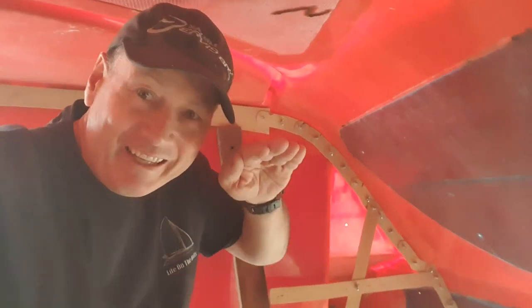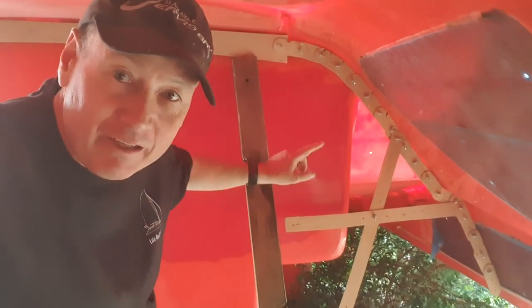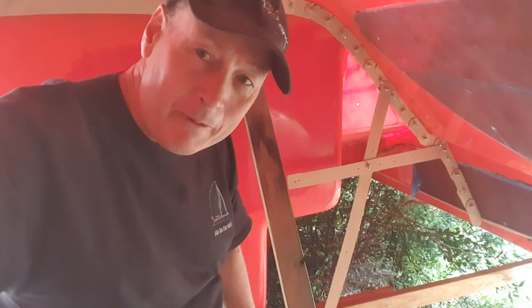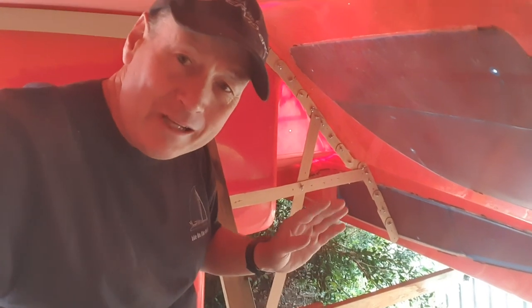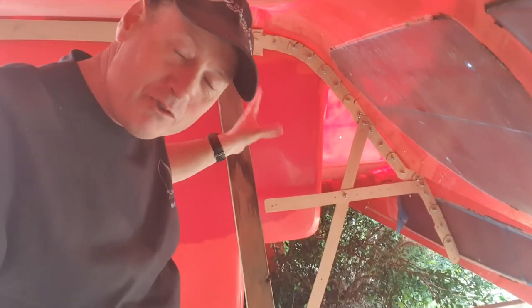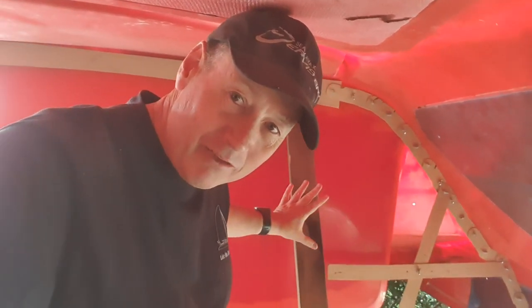It's been a little bit crouched in here because this mould's sitting on a downhill, so I'm bent over at about five feet high and I'm 6'3". I've actually determined most of this template — the problem is lifting it out and transferring it onto another piece. I'm using this 2x4 as a baseline to derive the template for up on the mould — that is in fact the hull edge. The nice thing is I've actually determined the level of the hull side, so if I transfer that properly over onto the hull, I'm pretty much dead accurate. But it's not a complete bulkhead — it's a partial bulkhead, actually shaped to fit and physically adhere to the physical deck as it caps over the top.